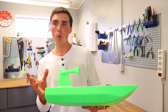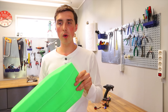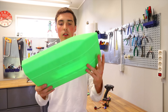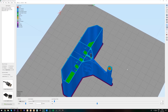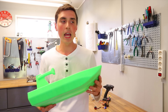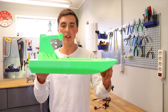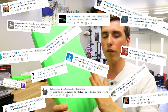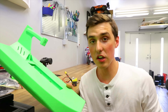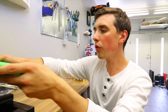The reason we didn't find much success with the boat was because water would creep through the PLA material into the boat. I think it wasn't thick enough — it was only two perimeters. So with this RC airboat I designed it to be four perimeters thick, meaning the printer will go back and forth four times to build the walls and protect against water getting in. That seems to work — I left it in the bathtub for over an hour and it still wouldn't take in water. One popular comment was to use Flex Seal, but I don't think that's necessary. The main challenge is to make a pure 3D print waterproof, and clearly you can do it.